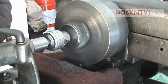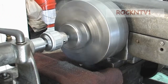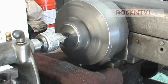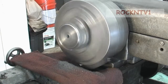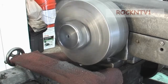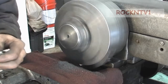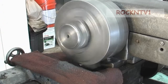Now, that's not to say that I haven't had the inch and a quarter pigtail in there, because I have. But in this Logan, you only got a little keyway in there that keeps the spindle from turning. In my little mini-lathe, that's only a little tiny drive pin. So just something to think about next time you're drilling holes with your little mini-lathe. Think about the fact that if that keyway breaks off while you're drilling in a hole, there's a good possibility that it's going to spin that tailstock spindle inside the tailstock housing and you are going to do some damage.